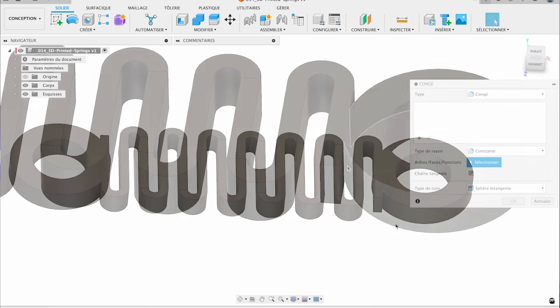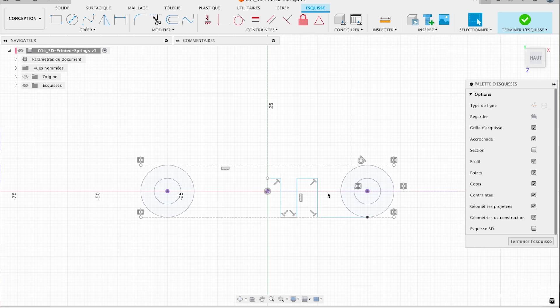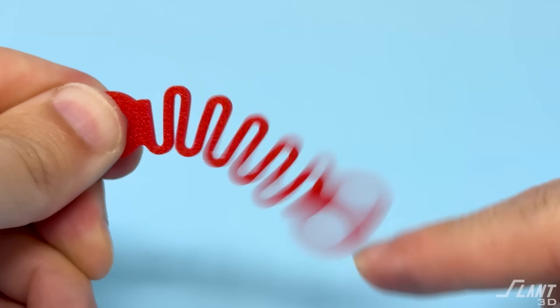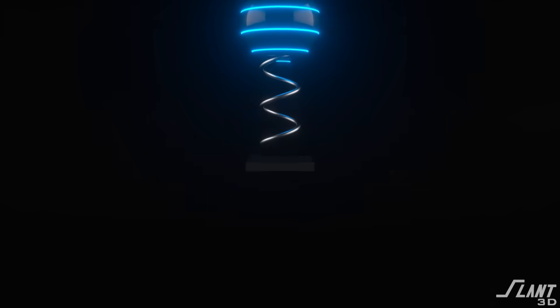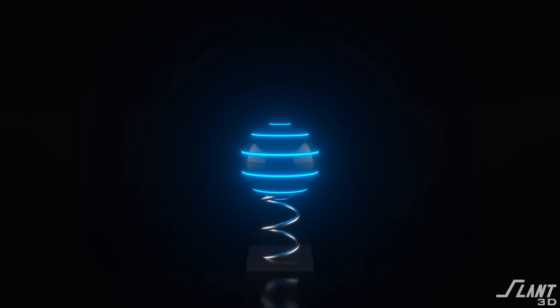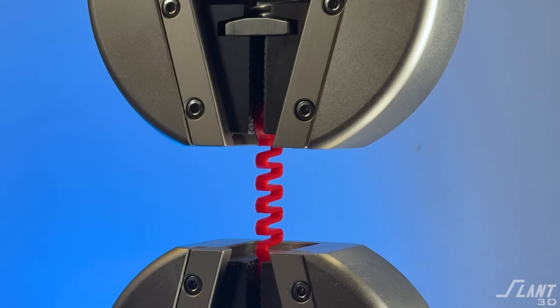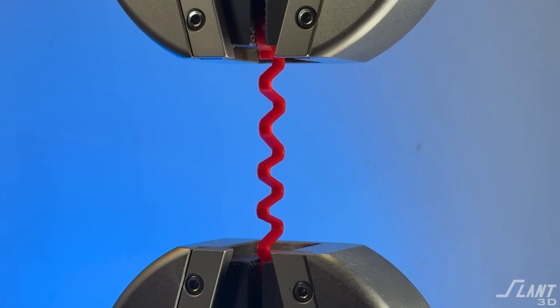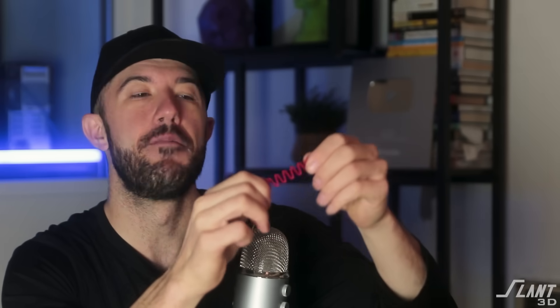You can change how that path works. The easiest way is to design a set of pattern slots and make sure you round out the edges — do make sure you round out the edges. Sometimes people make these springs perfectly square, but then you have a stress concentration at those corners. Do these springs compare to regular circular extension springs? They're not quite as good because regular circular extension springs distribute the force perfectly continuously all the way around that coil, whereas with these, the force is concentrated at the rotation points. If this breaks, it's going to break right there below the curve. To adjust stiffness: make the material thicker for stiffer, thinner down to one millimeter for softer.